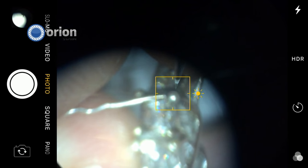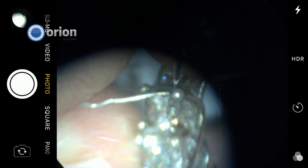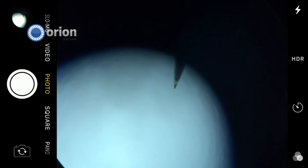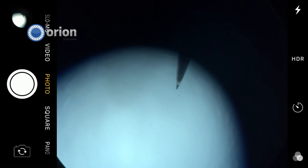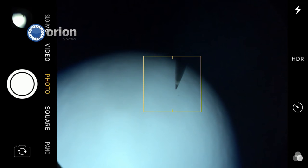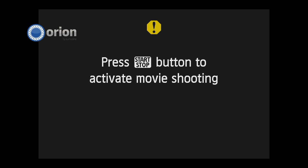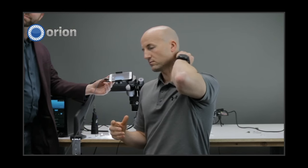We had a question: what if you want to use 14 karat white gold wire to tip on a sterling silver prong? Using a different metal is going to make the color look different. We recommend using the same metal wire as what you're welding. With pulse arc welding machines you can mix metals — that's no problem at all — it's just going to change the color.